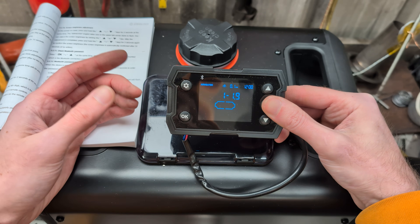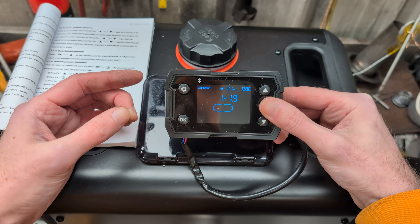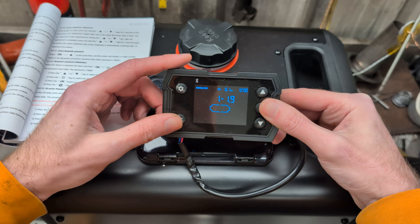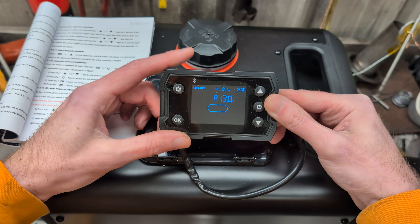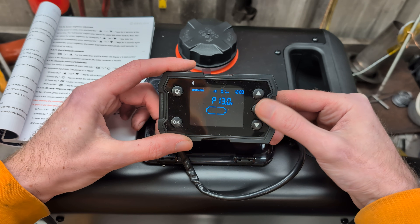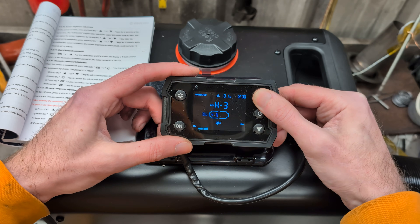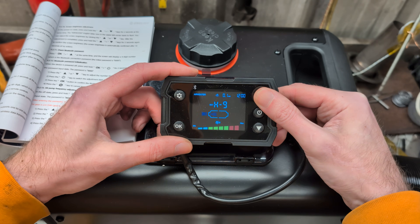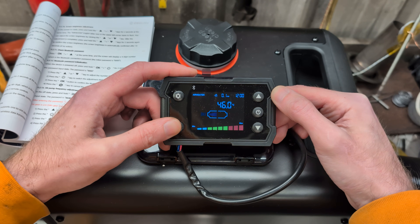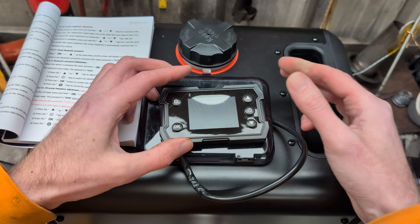The process is the same whether you're tuning the top or the bottom: get the heater up to temperature, reduce the power to the level you want to tune, and then take your carbon monoxide reading once the housing temperature has stabilised. So now we're set with slightly less top-end fuel — we'll turn it back on and take another carbon monoxide reading once it's up to temperature again. We'll let it get up to 230 and see what the reading is.